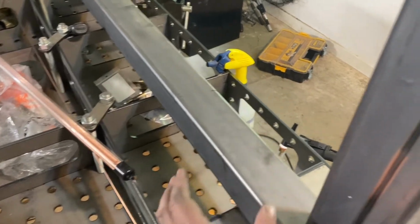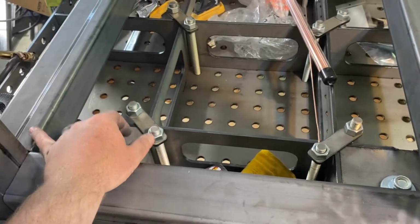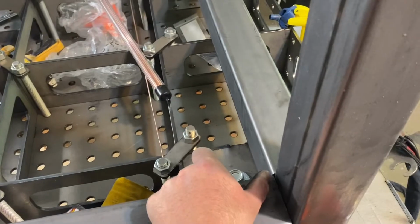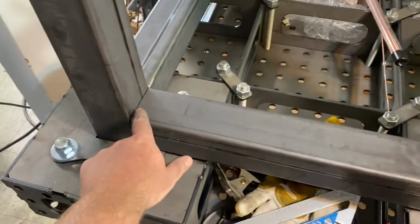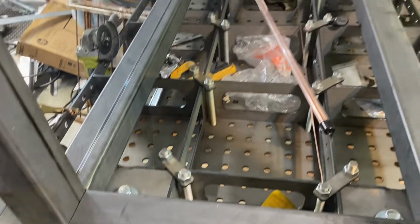So I'm just gonna bring it in maybe 3 inches on either side. Maybe I'll use one of these as a spacer to essentially start it right here and start it right here. That would give me, I think, plenty of room. So, all right. Let's clean up these pieces with just a flap disc around the edges we're gonna be welding, and let's start tacking things together.